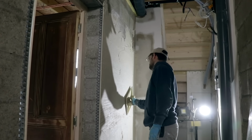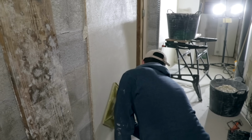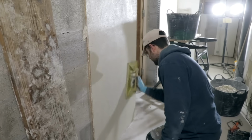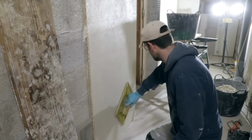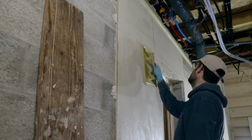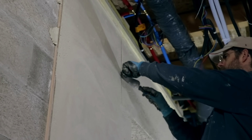So he wanted to go with something different. He asked for advice at the hardware store, and they advised this, which is called an enduit monocouche, that you would actually use for exterior walls, but you can also use it for interior walls. But it's not the kind of product that we would use in the Netherlands. He's been looking everywhere for it. He couldn't find it. And the guy at the hardware store said, well, that craft doesn't exist anymore. People in France, is what he said, prefer to just put a placo, so a drywall, up to this wall and then plaster that. People don't, according to him, put that plaster kind of thing on a wall like this.